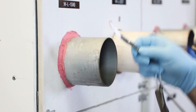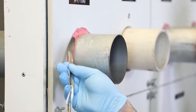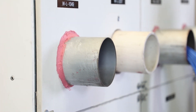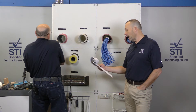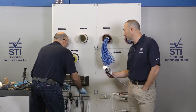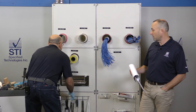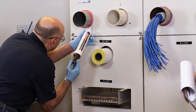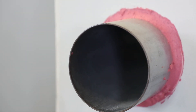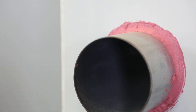Our sealant will give us the fire rating back — five eighths depth of sealant. Where there is point contact, we're going to have a buildup of three eighths of an inch bead of sealant that Eddie is finishing off. There's nothing in this system that would require that, but it is best practices because it gives us the proper depth.